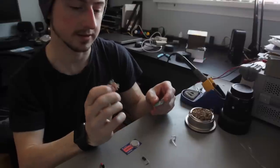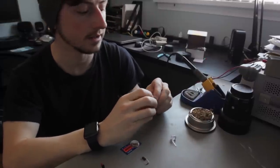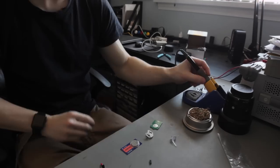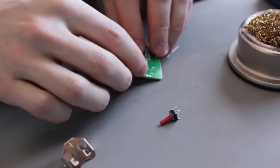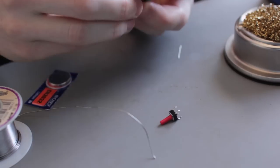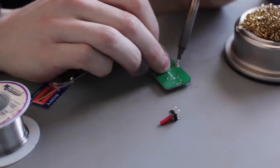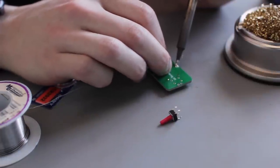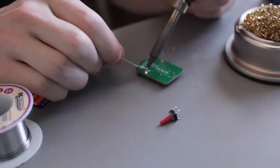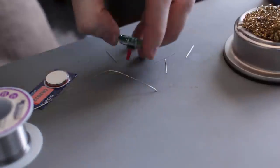Now with the battery connector — this is a giant piece of metal, so it's going to take more heat to solder. You also have to be careful because when you're soldering it on, it's going to get hot. If you're touching any piece of this while soldering, it may burn your fingers. You want to make sure the solder actually attaches to the battery connector, meaning you've put heat into the connector, otherwise you'd have a cold solder joint, which means it's not actually connected. The button should snap in place, making it easy to solder.